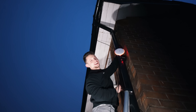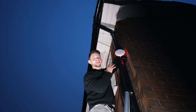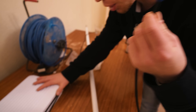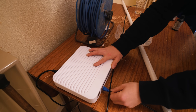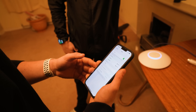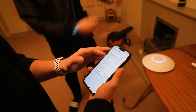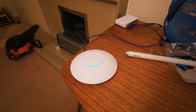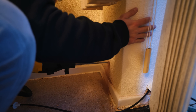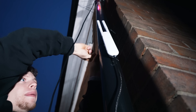I drilled up the receiving unit on the exterior of Tom's new house, ran the cable down into the new lounge, and off we were — connected to the broadband connection at the main house, just like that, 500 meg. Our next job was simply to tack in all of the cables and use another network switch inside the new house to power both the receiving unit and the new access points. We've got a Wi-Fi 6 unit which is going to live in the house and provide coverage in there, and then the little mesh unit which we had to drill another cable outside to mount on the drain pipe.